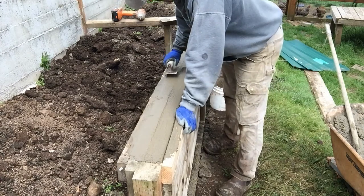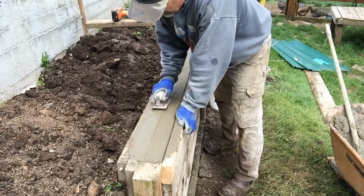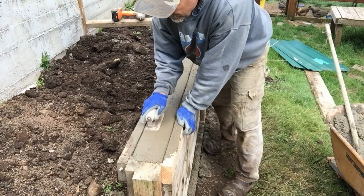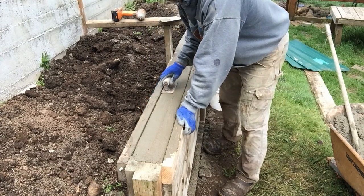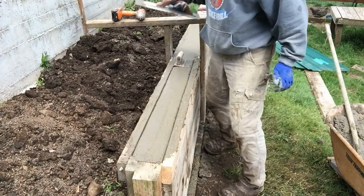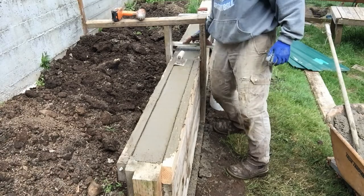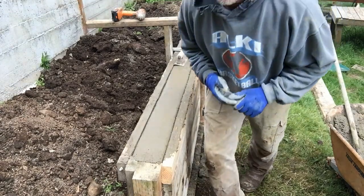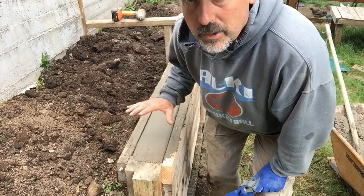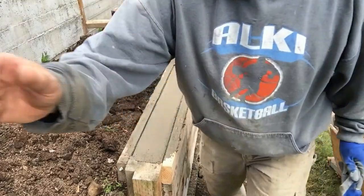All I'm really doing here, again, is getting those rocks off the edge that I'm going to have to work out later. It's a lot easier to do it, get them pushed in a little bit, and have just cream on the edges later. That's nowhere near finished, but this is a good place to leave it for about 45 minutes till I come back and finish it up.